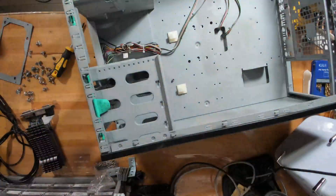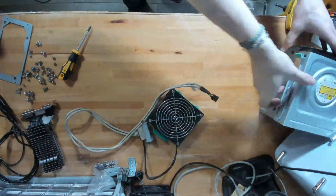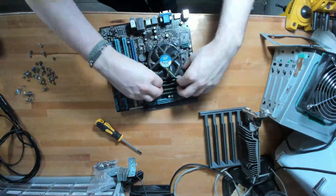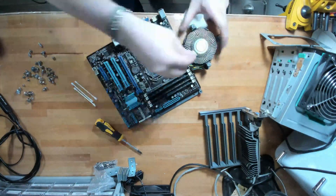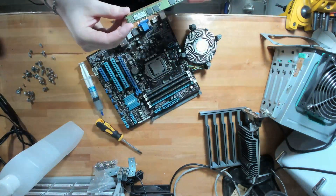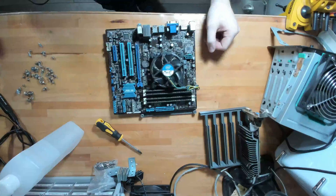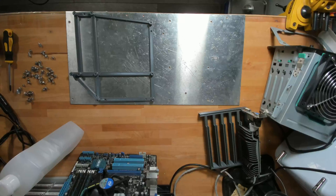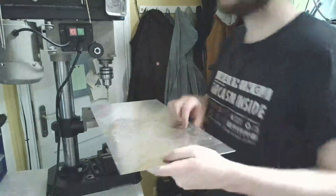Once I'm pleased with all the pieces I've disassembled, I lay them in front of the camera so you can see what I have. Sadly the USB cables were completely busted so those are not kept, as these computers are very old. One thing I do systematically is disassemble the heat sink and remove the old thermal paste to apply new thermal paste. This one was okay, but most I've disassembled had thermal paste that was just crusty, crumbling, and honestly not doing much for cooling. This one surprisingly also had grime in the USB ports.